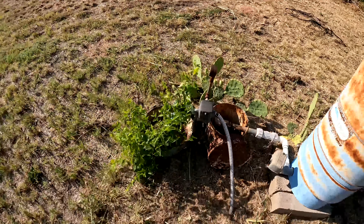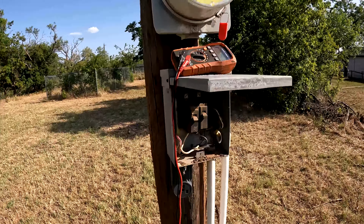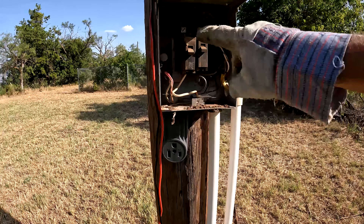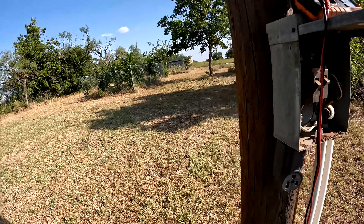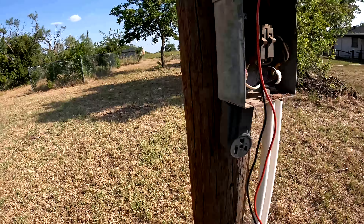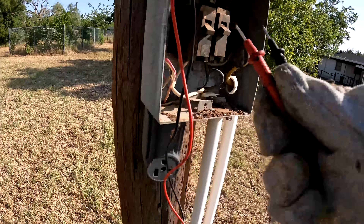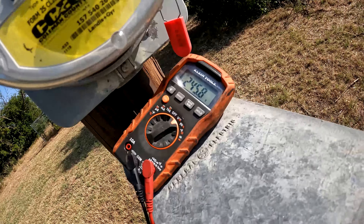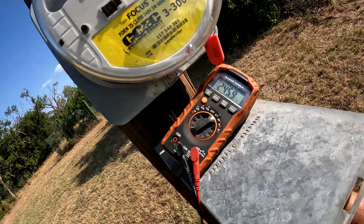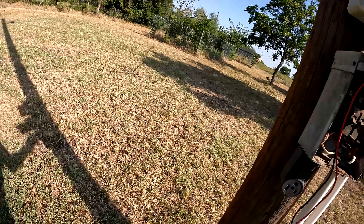There's a pipe that goes down there to bring the water up. My big thing was I wanted to see if we got any power out here. I traced the direction of that power line — it goes right out here to the meter. Somebody put a sub panel out here. It's going to have to be replaced because the breaker doesn't even really stay on. If we put our leads up to it — I've got to do this one-handed, I don't have any help here — we got 240 volts. So we've got power.